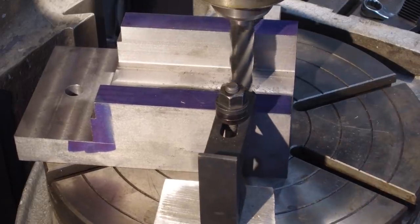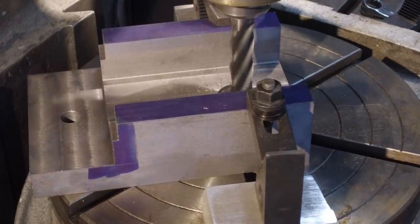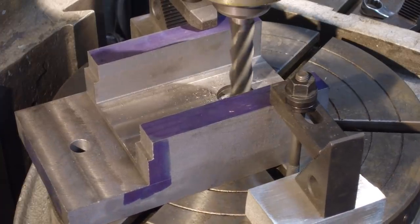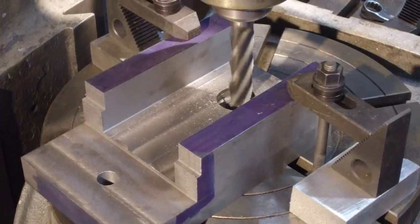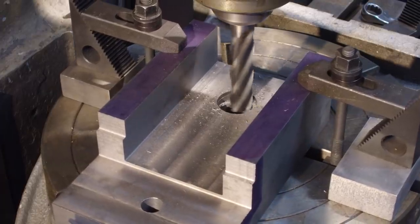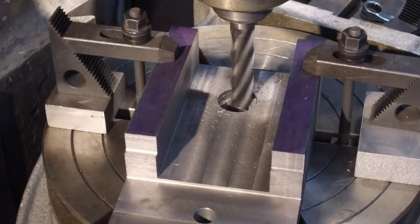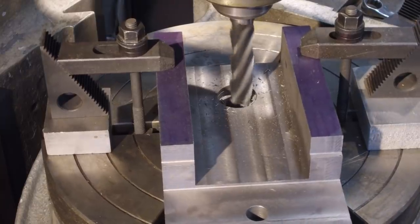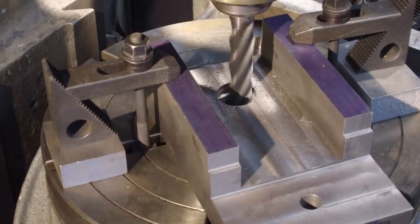Now I can see a little line there where we're not quite clearing out to that first cut there. So we're going to probably take a couple and go around, just so it visually looks smooth all the way around that bore with no steps in it. Or counter bore, I should say. That's what this is. And it could be tool pressure that's holding it out as well.